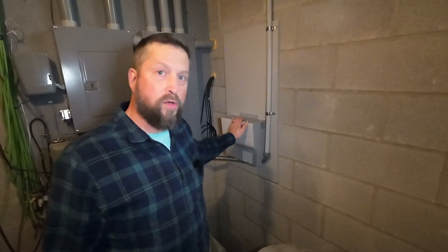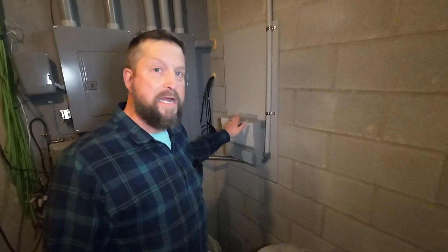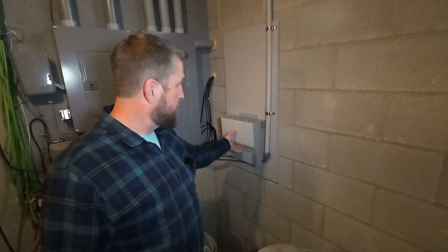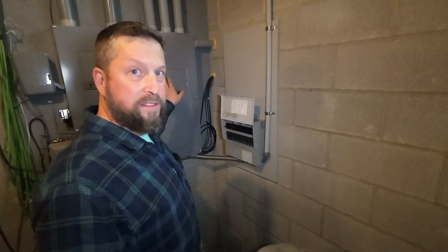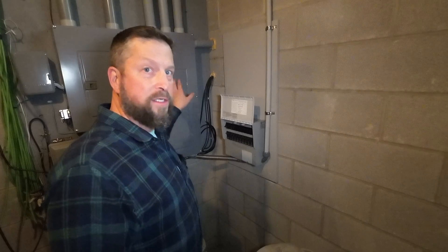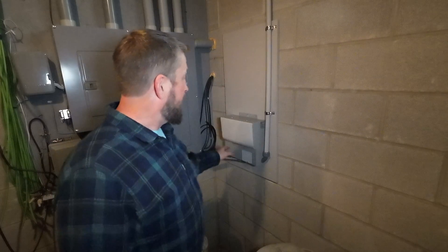This is a very nice, clean setup. I really like this Reliance Controls manual transfer switch — it can never back-feed into the system. When you switch from line to generator, it disconnects whatever power is coming from the grid, so when power comes back on you're never at risk of back-feeding. Now with the inlet on the outside of the house, I don't have to worry about running cables through windows — I just plug in outside and all the exhaust stays out there. Hope you enjoyed it — please give a thumbs up, hit subscribe, and I'll see you next time.